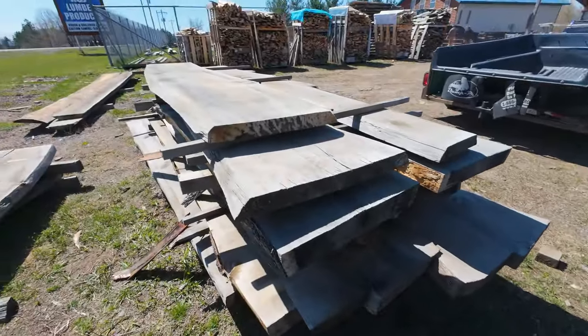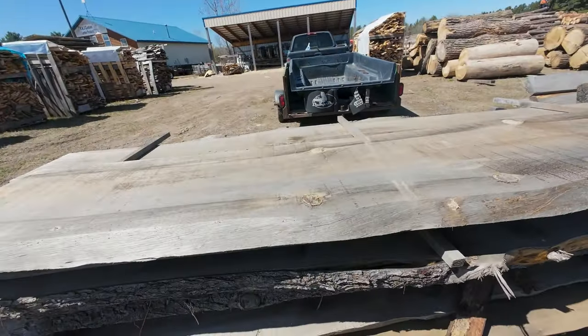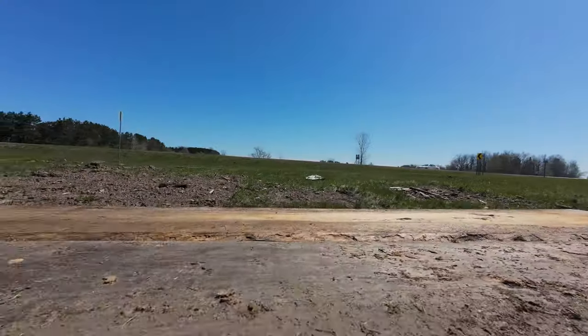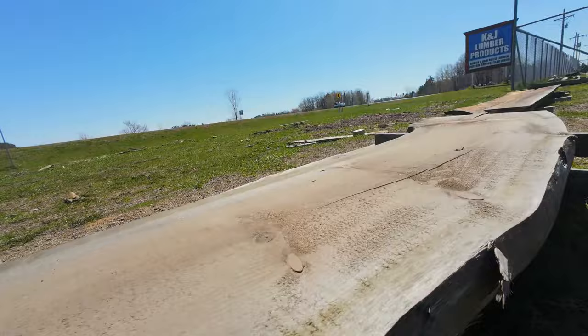For those of you wanting to tread the middle ground, using air dried lumber could be a decent compliment. Although it won't offer the precision and consistency of kiln dried lumber, it can be a cost effective way of creating some projects that do not require it to be perfectly uniform. Especially if you live in an area that doesn't have high humidity fluctuations. Just expect it to look gray at first, thanks to the oxidation process. The sunlight will turn it that color. But usually planing or rigorous sanding should reveal its natural color and grain pattern underneath.